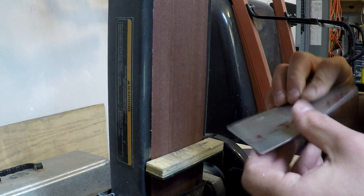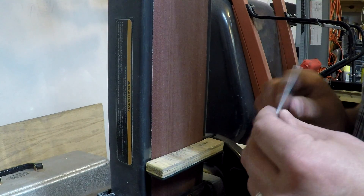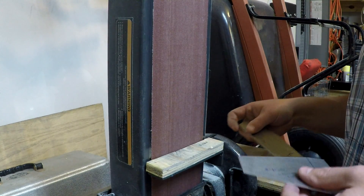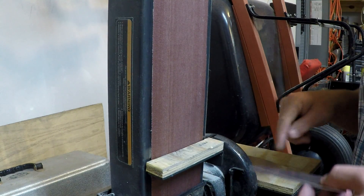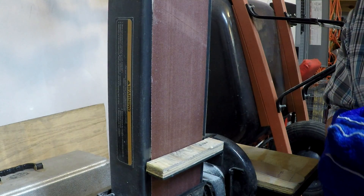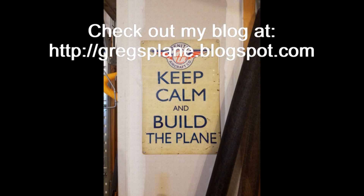You don't want to round the edge over - you just want to take the sharpness away. Feel how smooth it is with your thumb or finger. If you've already been making parts by hand it's really familiar technique just from filing. Alternatively, if you want to spend the money on a scotch bright wheel, that takes burrs off very nicely as well. The belt sander combination works very well; I like the belt for most of the work unless I simply can't maneuver the part and need the disc, as the disc loads up much more quickly than the belt. Anyway, thanks for watching this tooling tip - be sure to like, comment, or subscribe, and good luck with your projects.